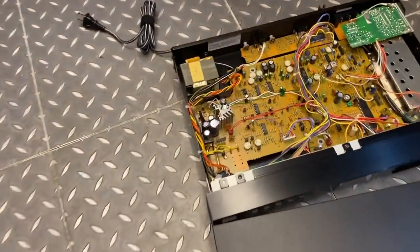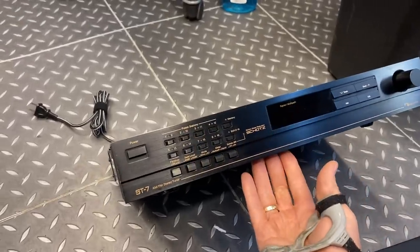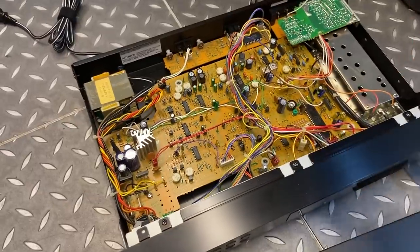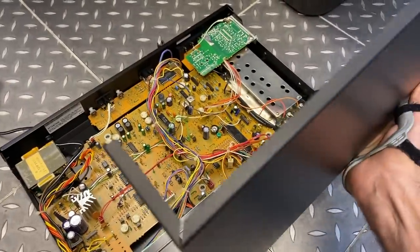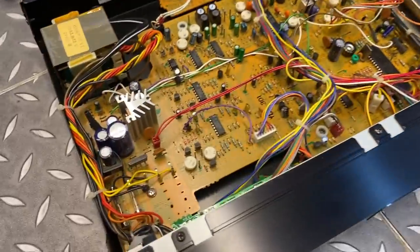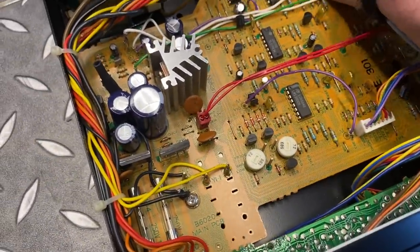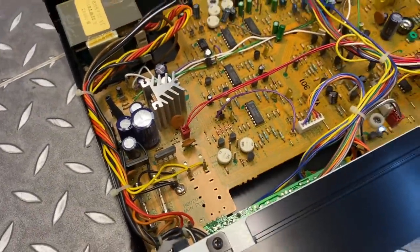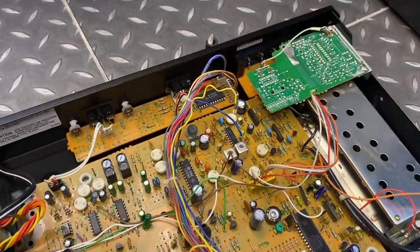And just magically the tuner appeared — thanks, Ben. This is the ST-7, the same series, and it looks exactly like a sibling to the other two pieces. But as you can see internally, it has nothing to do with them — from its stamped steel painted chassis to the material used on the circuit boards, the use of electrolytic capacitors throughout, and the messy wiring and layout. It's a good sounding tuner, don't get me wrong, but nowhere in the league of the other two pieces.